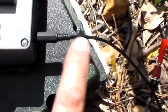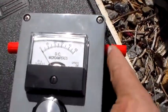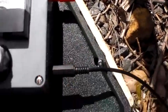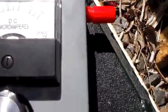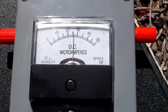When this plugs in here, it disconnects the voltage from the internal pickup point and inserts the voltage from the pickup point on the peg. As you can see, I've unclipped it — it's gone to zero. Clip it back on — it's gone back up.